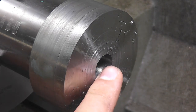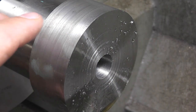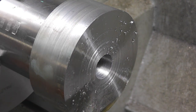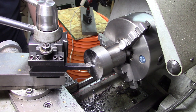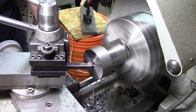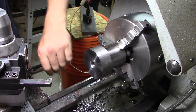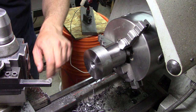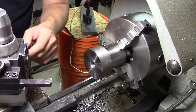What I'd like to do now is chamfer this end with a little wider chamfer than usual. That way I can use the live center on this end to support the material as I start machining the two grooves at the right diameters. I've set the compound to basically 30 degrees, which makes a 60 degree included angle, which will work for the live center. This little chamfer is not going to cause a problem as far as shaft contact or for cutting the keyway with the broach, so it'll be fine.